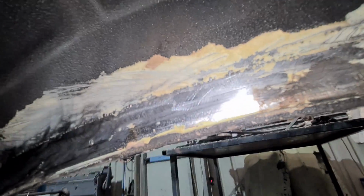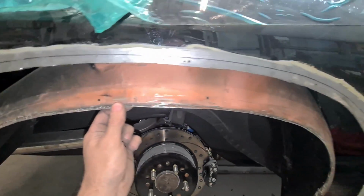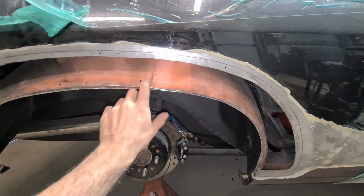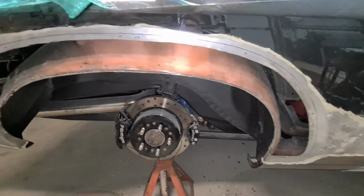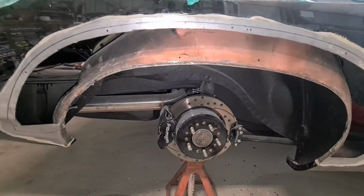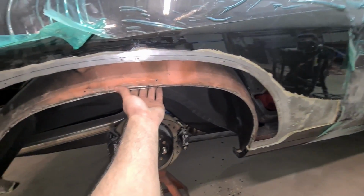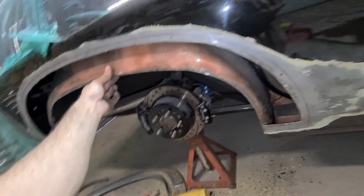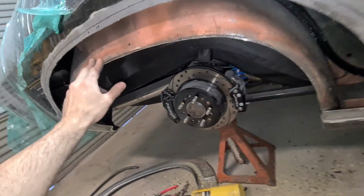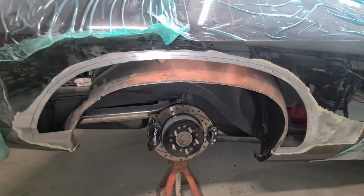That's where they've cut the inner wheel arch and raised it up to keep this existing shape, because they fucked up by putting the wheel arch too high. They had to cut the inner and move everything up and fudge it instead of just putting the outer down to where it needs to be. You think the alarm bells would start ringing when you go to fit it and you have to cut the inner of one side but not the other, and you think maybe I should check on the other side and see if this is the same, instead of continuing and getting it to the point of the car being painted and then me coming back and fixing the fuck up and putting it where it needs to be. So silly.